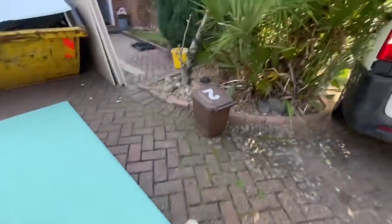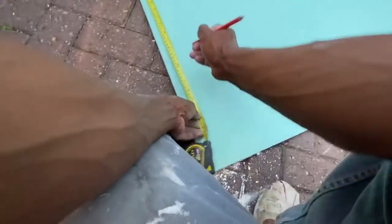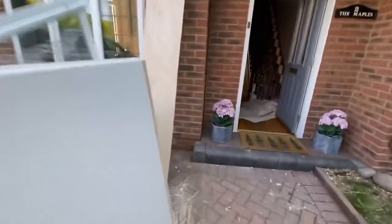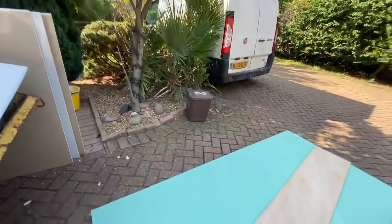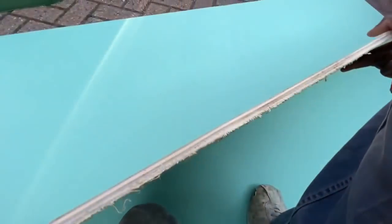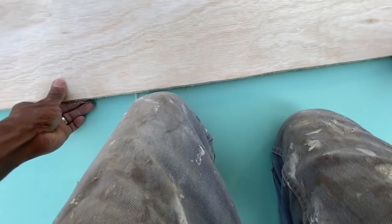These newer homes, unlike a lot of the older English homes, have a lot of partition walls, plasterboard walls, timber stud or aluminium stud walls. This house had aluminium stud walls pretty much all the way around the bathroom walls, the external walls as well as the internal walls. So best thing to do if you're removing tiles off a bathroom like this, it may seem or sound like a lot more work or expense, but it makes more sense to just rip the plasterboard out, take the tiles off, just take all the plasterboard off and replace it,